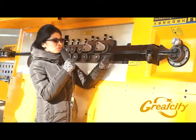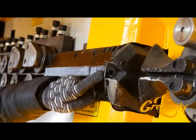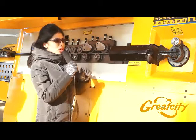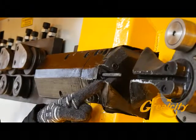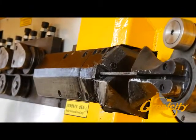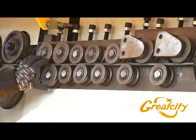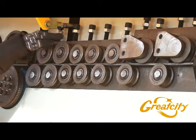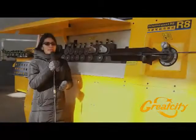When the wire is moving forward until it reaches the last part of the machine for straightening, keep the speed slow so it can reach the last side of the machine. When the wire is ready to be cut and to work, go back again and check each wheel if it is loose or not — tighten by screwing up each screw for the wheel before cutting or bending.